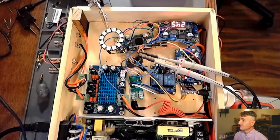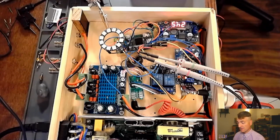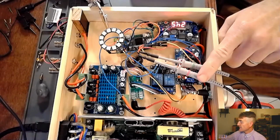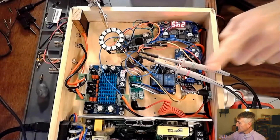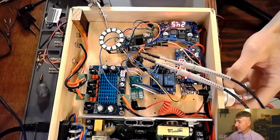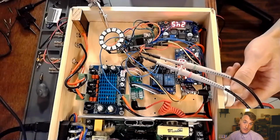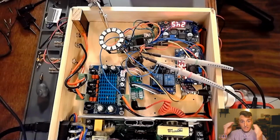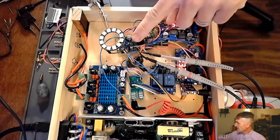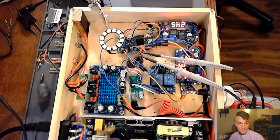I will begin first by describing my setup, and then we'll talk about what we're going to do. I have two probes connected today, monitoring the rotary encoder on the front of the scope. I want to monitor the rotary encoder A pin and the rotary encoder B pin, which is how I tell which direction the rotary encoder is turning. I need to check that out one more time. I am also connected to GPIO pin 12 with my NeoPixel. That's how I'm communicating to the NeoPixel.